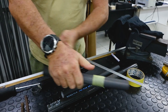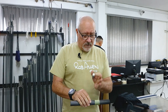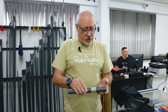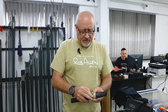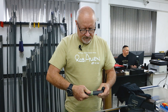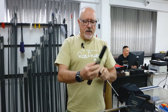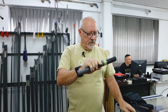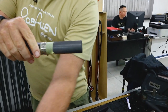Set your ruler position and mark the cut location. Now the problem with hand cutting is keeping it perfectly straight. My theory is to put a hose clamp on it and slide it into position — that band should give you an exact 90-degree position all the way around. We're going to use that as the guide.